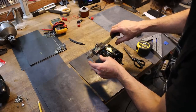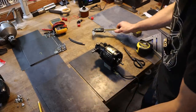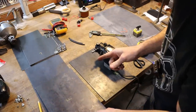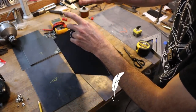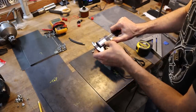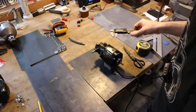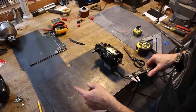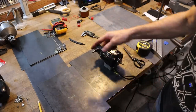Okay, so zero, and now we close it. So 3.2 inches off the top of this is where our hole is going to be, but this plate here, this edge, doesn't sit on the top of this, so it sits out front, actually, off of that. So we need to also add the thickness of the plate. That's 1/8 of an inch, I'm sure. What the heck? Zero. No? Yeah, 1/8. So close enough, 0.118. It's a little thinner, but you get the idea. So we need to add that to 3.2 inches. So 3.318. Close enough, right? We're going to drill it oversize anyway.